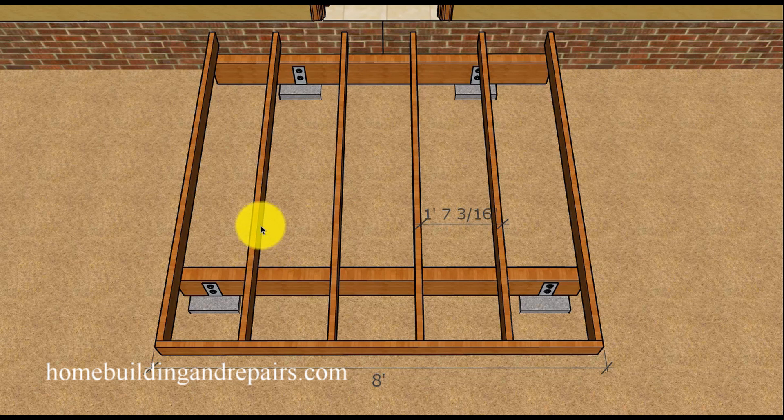Let's just say that the manufacturer of your decking says that 24 inches on center is the maximum, and you just kind of build, set a couple of joists two foot on center, and you lay the decking boards on top and step on it and go, 'this is too flimsy.' Move it to 19.2 inches, stand on it, see if it's still flimsy. And if not, then add a couple more joists.